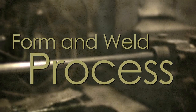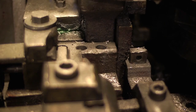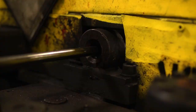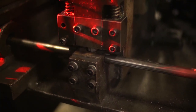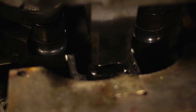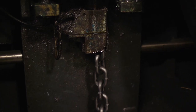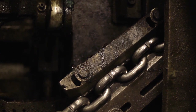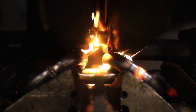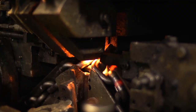Form and weld process. Chain is produced in cells of formers, welders, calibrators, and sometimes twisters. The former takes the wire, stamps the grade and trace code, and then cuts it to a length approximately the circumference of a chain link. This piece is formed into a link, interconnecting it with the previously formed link. Thus, a chain is created of wire formed links. The chain passes to the welder where each link is machine welded electrically with no filler by heating the edges of the wire ends and forging them together. The excess material is trimmed.